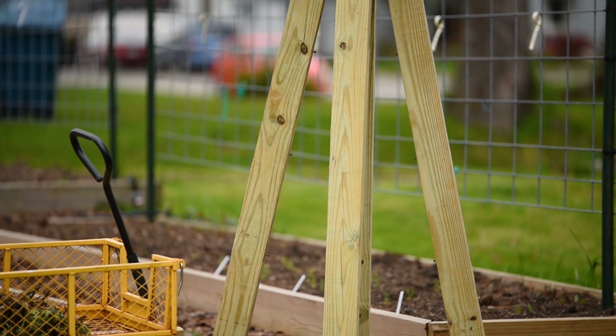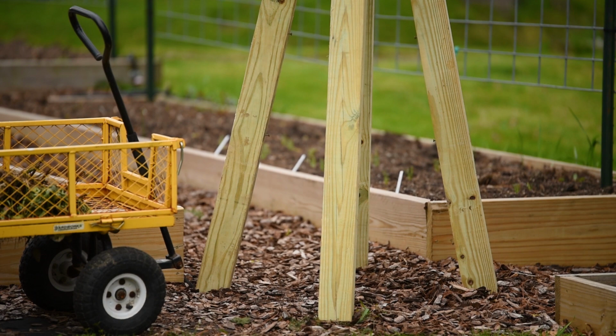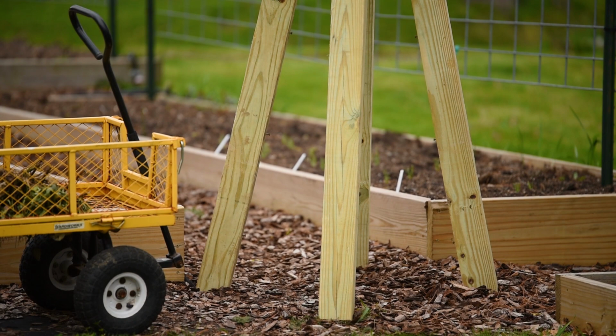But on treated lumber, you might end up with 3 5/8 by 3 5/8 or 3 3/4 by 3.5. I mean, you never know what you're gonna get. Nothing's square, everything's crooked. It's complicated. So to do precise carpentry doesn't make sense. So that's why I ended up going with just the plunge cut.